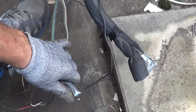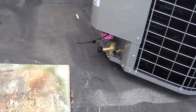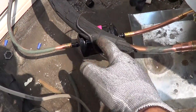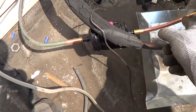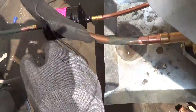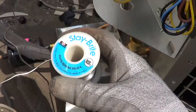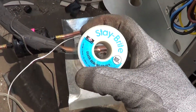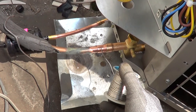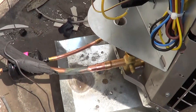I've already flushed the pipes and I'll put a filter dryer on it — actually the unit comes with a little filter dryer right there. I have the piping connected: here's the suction line where the gas comes back to the unit, and the liquid line where it goes out as a liquid to cool the house. The filter dryer right here keeps the Freon clean and also keeps the oil clean for the compressor. I'm going to solder with Staybrite silver-bearing soft solder, which melts at 425°F. This is used for refrigeration and it makes stronger joints; since it's a lower temperature, it doesn't burn up inside the copper and make slag.